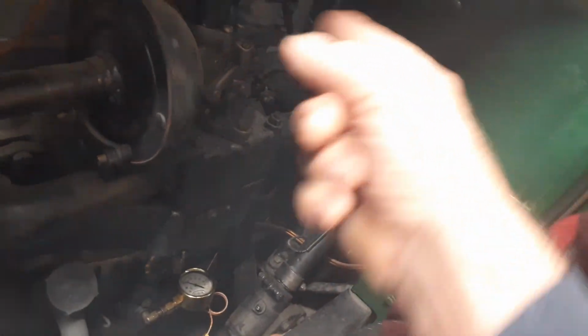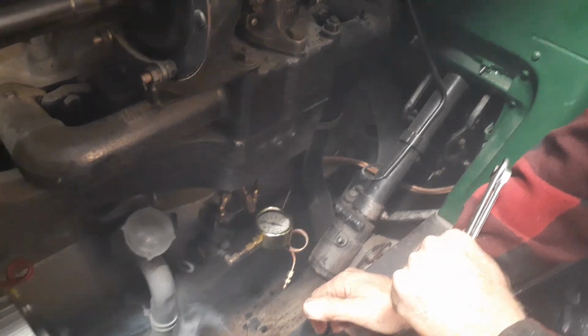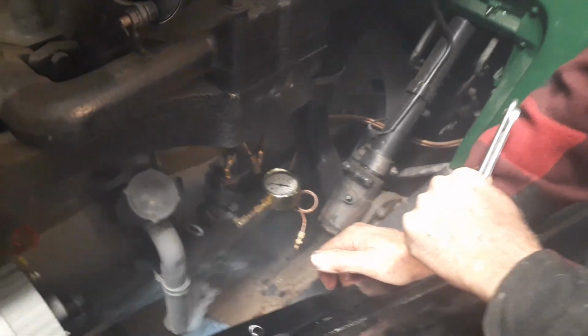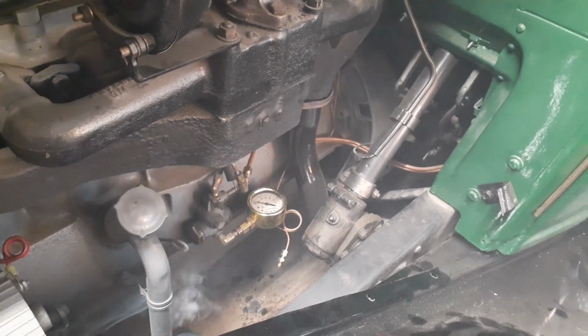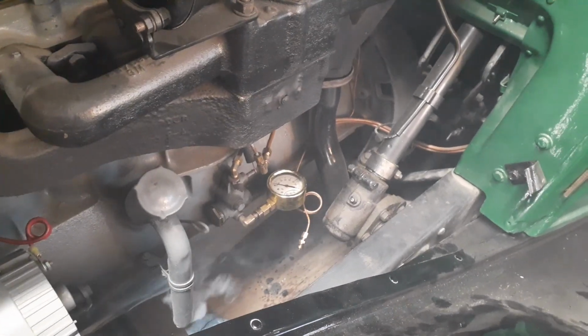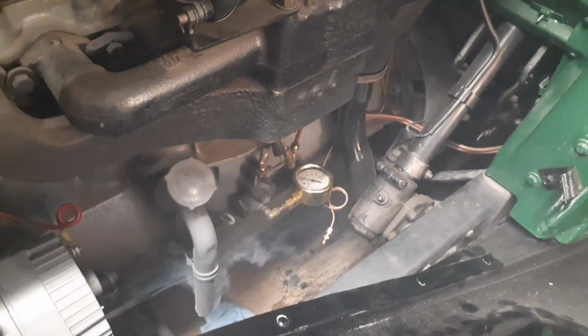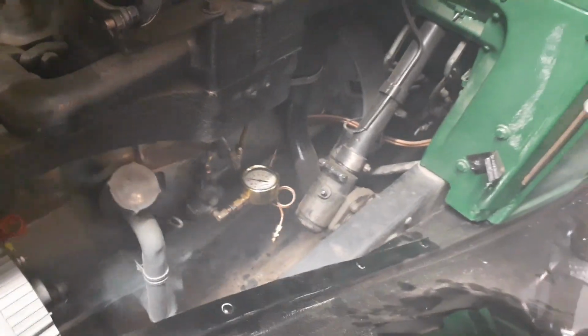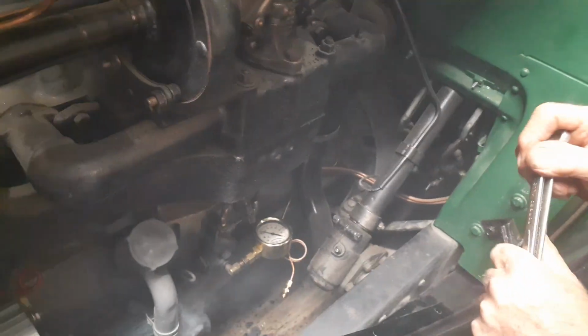The main thing you might want to do is sometimes take the valve cover off and see if I'm getting oil, because it has to spread the whole way and drip. It only drips a little tiny bit on each one. Yeah. If you're getting anything, that's plenty. I guess that would be the next thing to do, take the valve cover off and make sure I get the oil to the valve train.